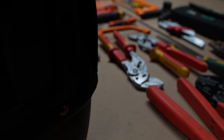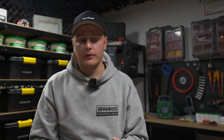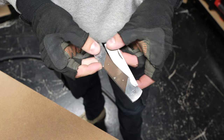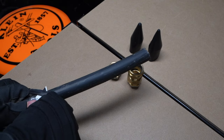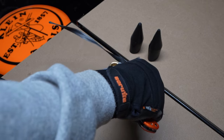Now, tools. First of all, you're going to need a knife — a Stanley knife specifically. You can use any knife; I've got nice wooden-handled craftsman knives and flick knives, but you're cutting into thick outer sheath and thick steel wire, so just grab a Stanley knife — something with disposable blades that can easily be replaced. And if you're caught short, you can find someone on site who will have some Stanley blades. That's why I recommend one.